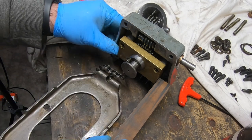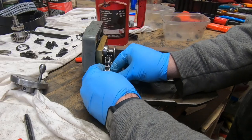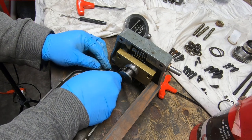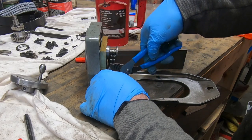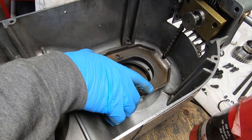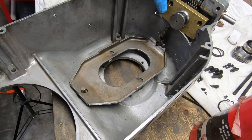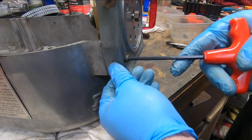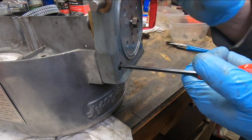The other end of the chain is pinned to this speed change lever. This lever essentially pulls up on one half of the variable speed pulleys - it is what ultimately allows you to change the RPM of the spindle on the fly. The other side of the speed change lever is pinned to the inside of the belt housing, and I'm going to loosely attach the faceplate to the belt housing for now just so these pieces stay together.